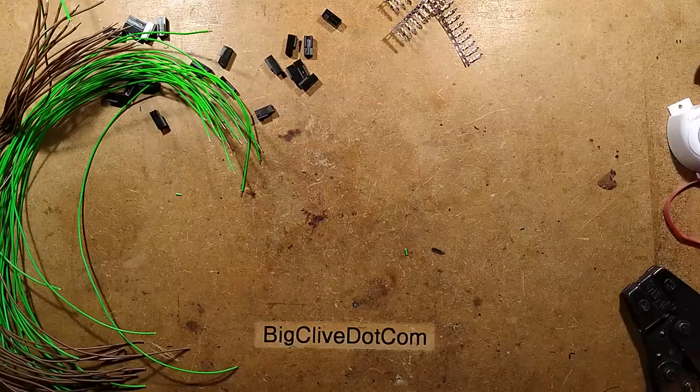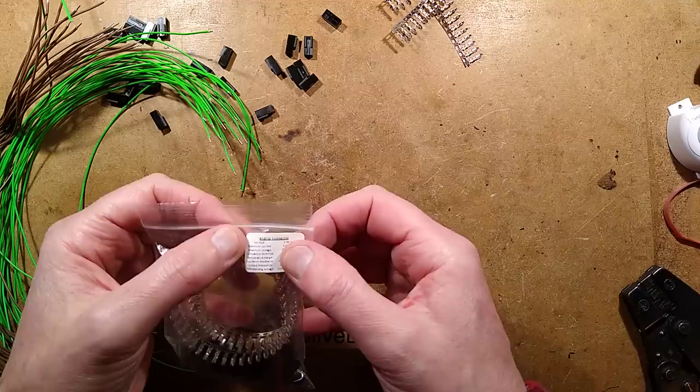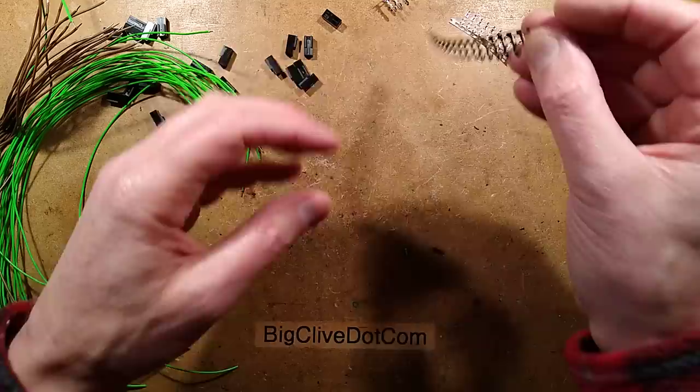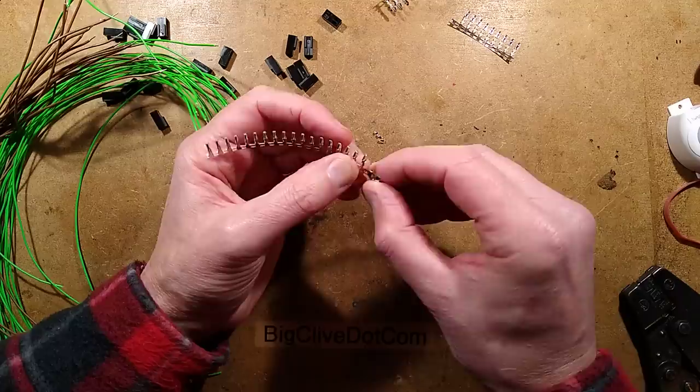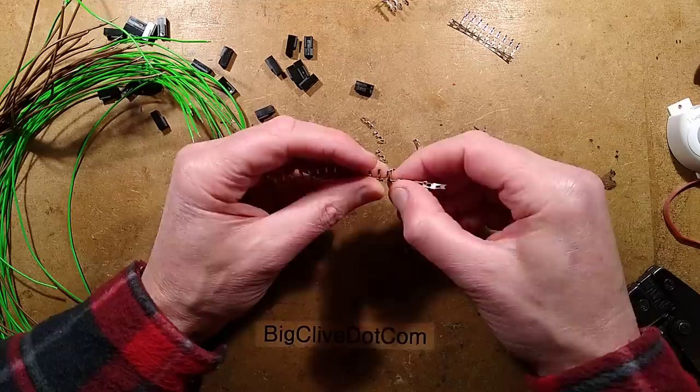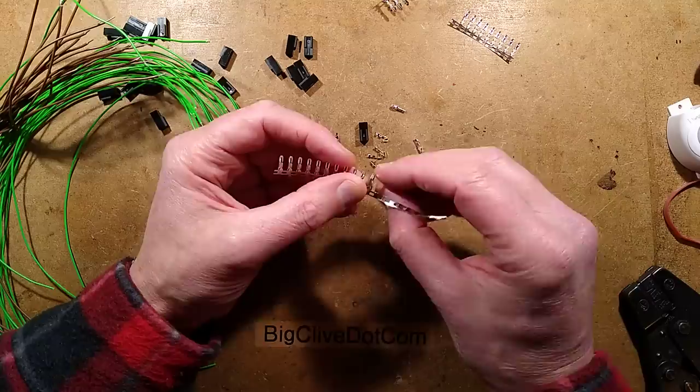The connector I'm using is my favourite — I often refer to it as a Molex connector, but in reality it's not. The online name is KF2510, a tenth-of-an-inch pitch connector, very common. This particular batch has really easy-to-separate contacts that come in a strip. Normally if you buy these from a supplier like RS Components or Rapid Electronics, you buy the shells separately and then strips of contacts. The black ones came from an eBay seller.